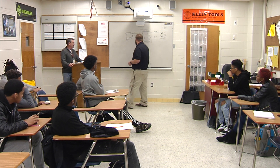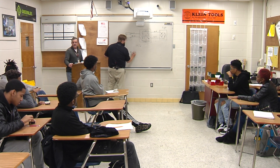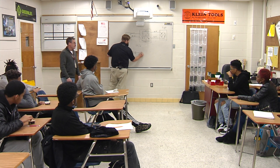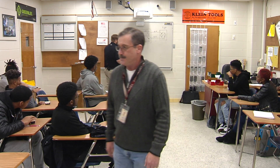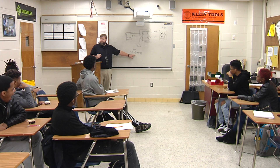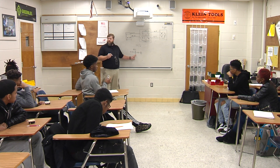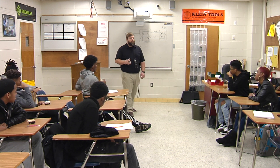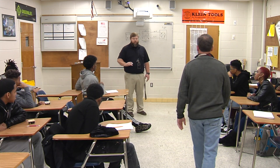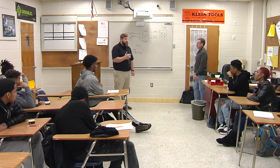What I want you guys to do is this schematic right here. The GFCI is here. This one I want protected — GFCI protected. The GFCI goes on the first box; second one is GFCI protected. Now usually this is going to be at countertop height, but I want these to be at regular receptacle height — 18 inches off the floor. Use those boxes that are at 18 inches and go ahead and wire these two.